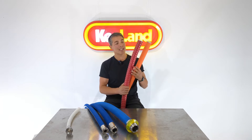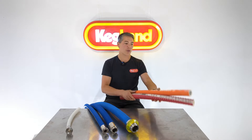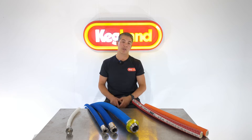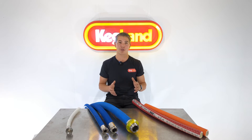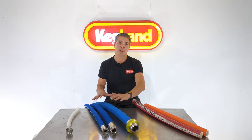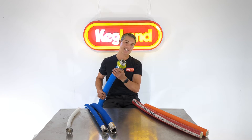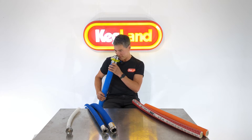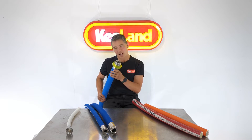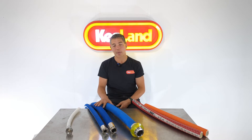It's a natural rubber of course, but one of the disadvantages of butyl rubber is it doesn't have quite as good chemical resistance. So if you're after better chemical resistance you may want to look at the EPDM hoses. The EPDM hoses — if you're the kind of person who abuses the hose or leaves acid or caustic in there for a while — maybe the EPDM are the way to go. They're the blue ones you'll see on the website. If you pick up an EPDM hose it does have a bit of an aroma — you can smell that slight rubbery smell.